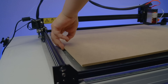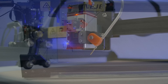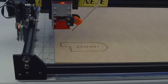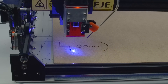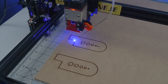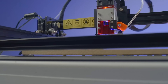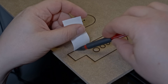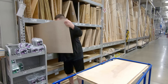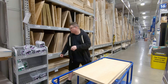Anyway, here's some quarter-inch MDF, and here's how simple it now is to set focus. Here's the test cut with the laser at full power, 200mm per minute, and the air assist wide open. This went on for a total of 16 passes, at which point I tried again, reducing the travel speed to 100mm per minute. Unfortunately, the beam never made it to the other side, and after a closer inspection, it looks like it hasn't even made it halfway through. So, there's our medium-density materials performance in a nutshell, and I have to think that we'll do better with plywood.